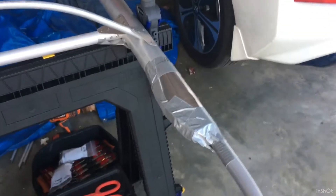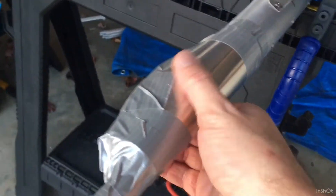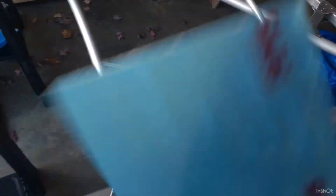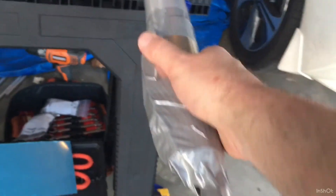I redesigned — talked to Tom, redesigned — the spar-to-wing-tip gusset. I know it doesn't look very good right now, but it's actually on here really well. Basically what I did is I cut the sheet — it starts off like this, the sheet is bent around here — and I cut it so it's big on this side and can wrap almost all the way around. There's a gap here; I put a rivet in here, and I put two rivets — one on the top of the sheet, one on the bottom of the sheet — so that kept it on there, and then I tapered it back and put one rivet in the front right here. It's on there really solid now.